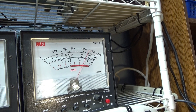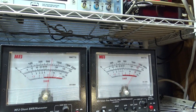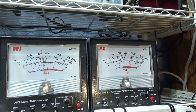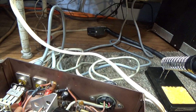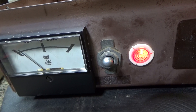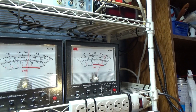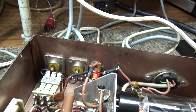Just keying it down - it's a customer's radio, just showing the thing's working, nothing's overheated. This is my power supply though - he just sent the head unit only. The meter's adjusting pot is bad, and that's why the meter isn't reading as it should. Other than that, everything's working - just connecting that one wire that was underneath that you couldn't see.